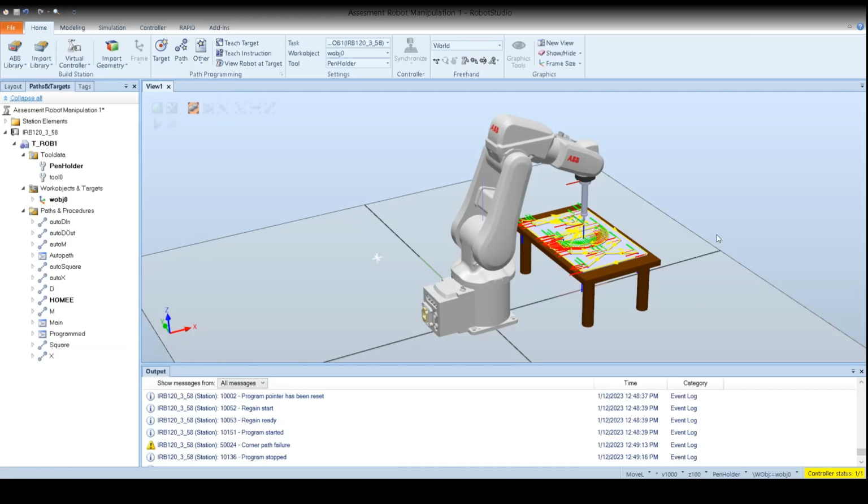Greetings. This is the second video of RobotStudio, continuing from our previous one, where we programmed our ABB IRB 120 manipulator to draw the Middlesex University acronym using a pen holder. In this case, we upgraded the system so the task can be achieved using both pre-programmed targets and paths, but also using autopath. The main difference between each method is that autopath allows the programmer to get the path quicker, but it must have a physical surface to do so.